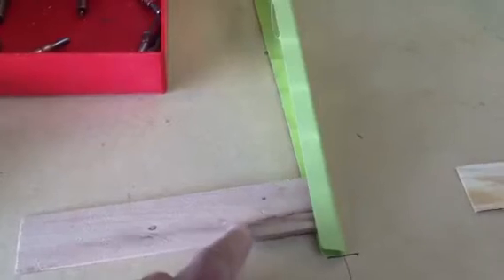If you've got the Bearhawk Builders books, you saw the technique of using door shims brad-nailed to your workbench to hold down your ribs flat to the table. I also did the same thing. You can see that I'm not flat to the table right now because I had to take the fixture loose to get the leading edge out. You can see how I bent down the trailing edge here to give it some strength and keep it away from the fabric when it's covered.